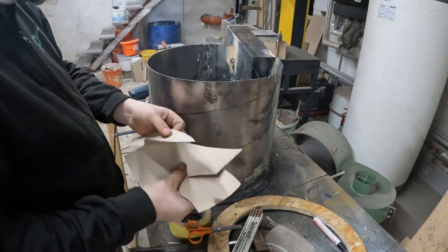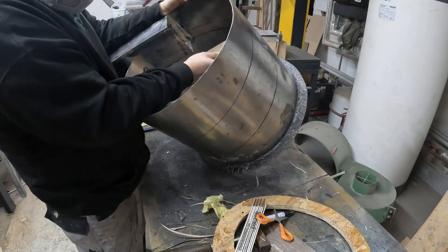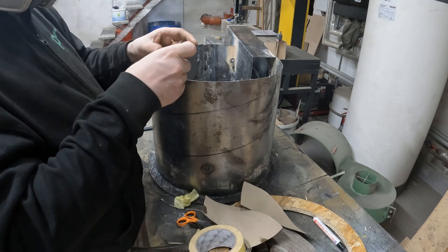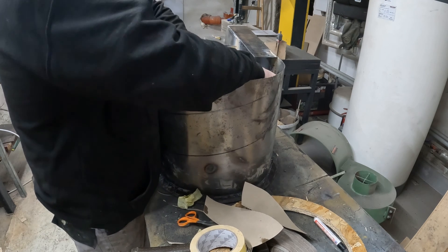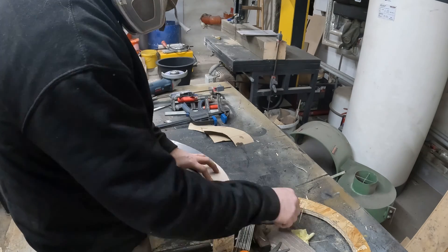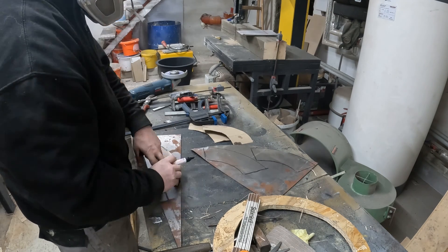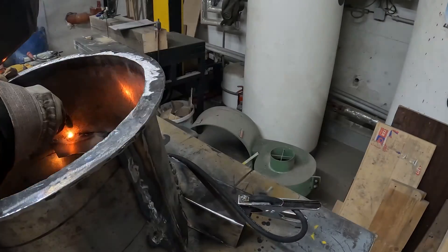Now on to the inner spiral. First things first, I began by cutting several fins from cardboard. The initial idea was to make them oversized, allowing room for adjustments later. To secure the fins inside the cylinder I opted for a simple yet effective solution — adhesive tape. I carefully attached the fins one by one on the inner surface, making sure they were well placed until I was satisfied. After the cardboard spiral prototype was ready, I transferred the measurements of the cardboard fins onto a metal sheet. Using a trusty angle grinder, I cut the metal sheet into the desired fin shapes. Then it was time to weld them into the inner part of the cylinder.